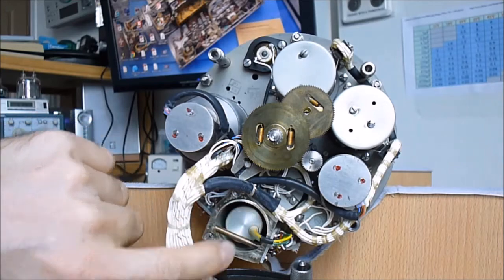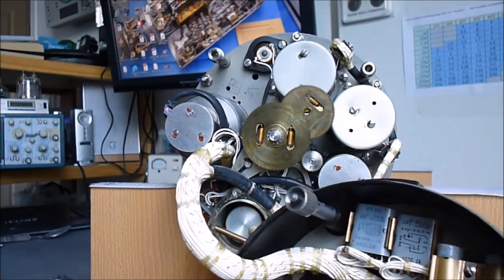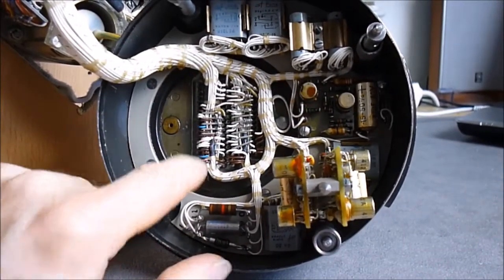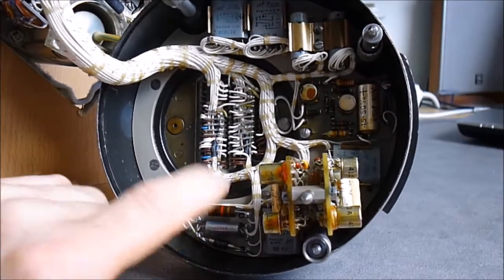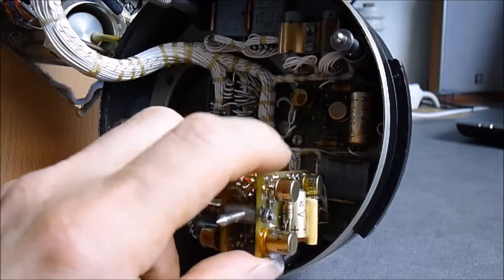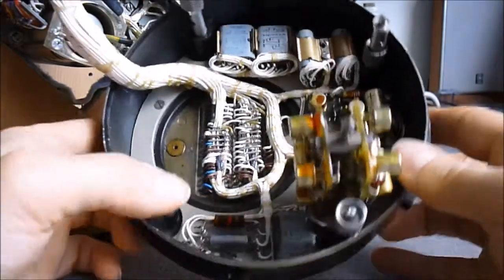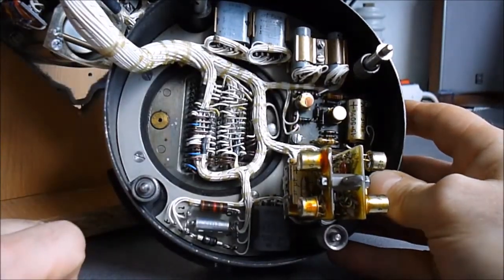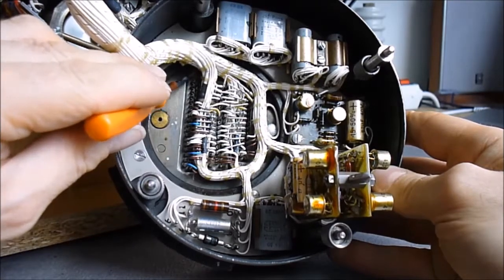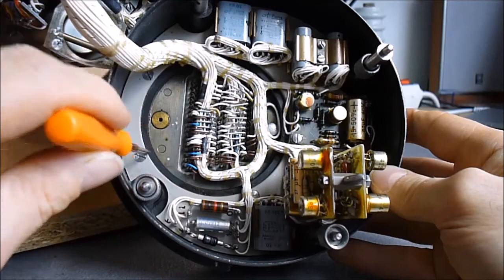It looks fixed with O-rings, maybe just for centering in the case — it is all pretty serious metalwork in aluminum. Now the bolts are removed, the couplers are removed, and I can open it. Here we have the end of the synchro motors — this one is a double-stage. More grills, more synchro resolvers and motors, transmitters and whatnot. One, two, three, four — six, seven, eight things in this.